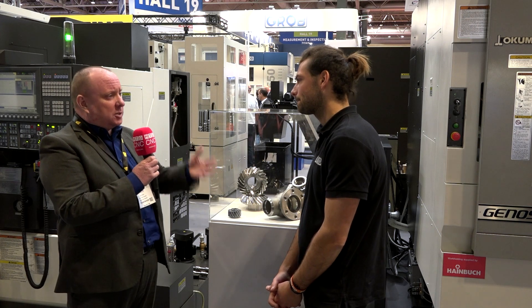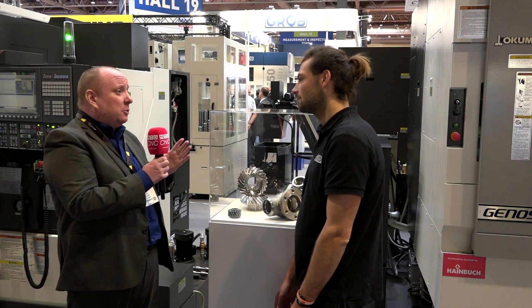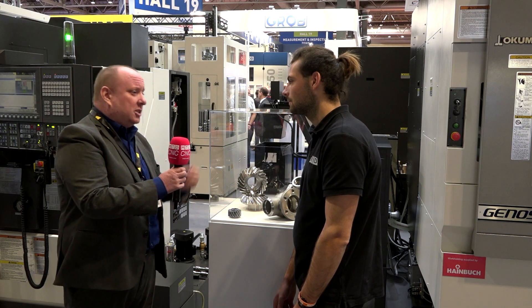We have had experience exporting models — IGES format, STEP formats — universal for other CAD/CAM systems, and they would generate the toolpath. But it would take maybe a couple of days to generate the complex tooth path. Our export now works in a couple of seconds, and they have it micron correct. The advantage of generating the G-code ourselves is we know it's not been changed. If you export it and somebody changes it to suit the model — stretches it out — that will affect the contact. So you check it in our system first, then export it to the machine.